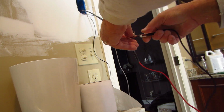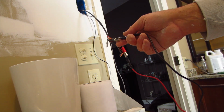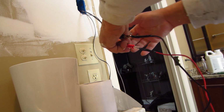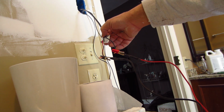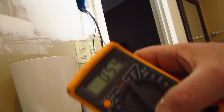Before you actually put it into use, you need to let the thinset and all the setting materials cure for 10 days. And then once the 10 days has passed, you can put it into normal use. Okay, so that's it. The next video will be in the actual setting of the tile floor.